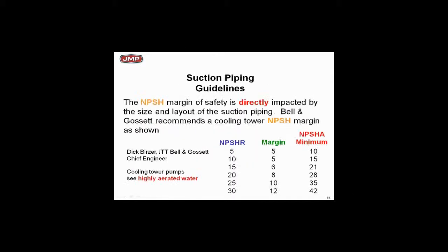Last but not least, you need a safety margin on your NPSH. This is a guideline recommendation from Bell and Gossett — it would apply to any pump. You don't want to design your systems right on the edge. Note the left-hand column for cooling tower pumps: cooling towers have highly aerated water to deal with, so you've got air bubbles as well as the NPSH concern.